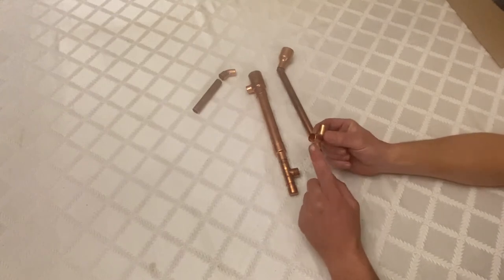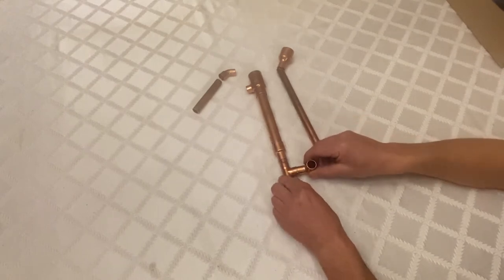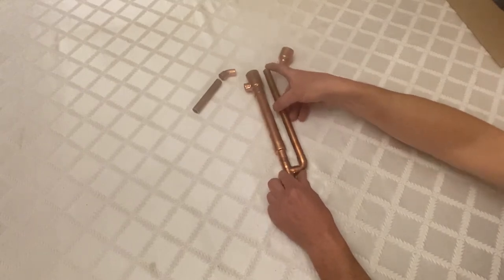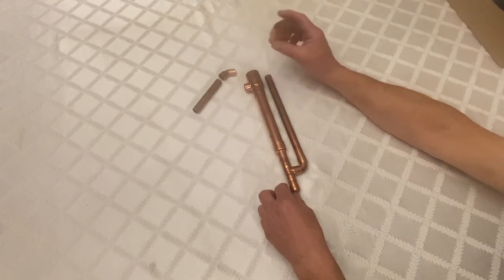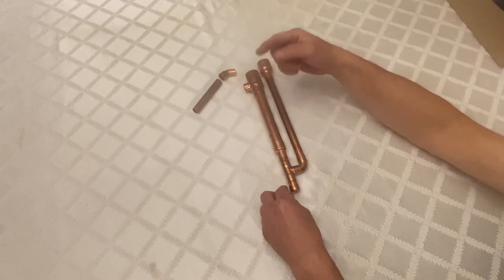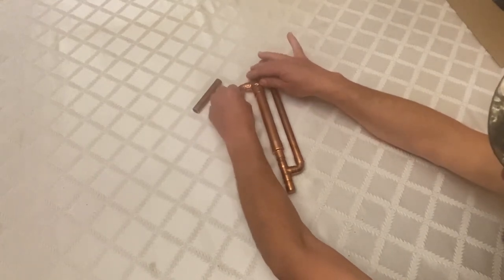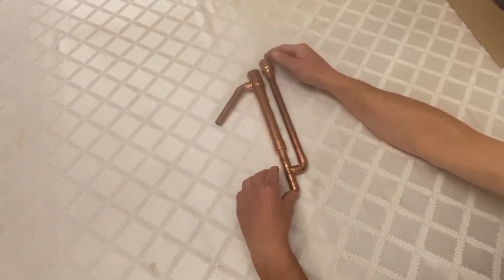To connect your collection tube, I like to use a 90-degree street elbow — 'street elbow' means one end is a half inch outside diameter and the other is a half inch inside diameter, which makes it easier to connect without cutting little pieces of copper pipe. The length should be set so that when you connect your collection tube, this part — a one inch by half inch reducer — will allow this part to be higher than your dispenser and testing part, because liquid will always find its own level. I also have a 45-degree street elbow, same type of inside and outside diameter, and then this small piece of copper pipe you would cut to length depending on what type of jar you are using.